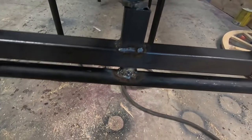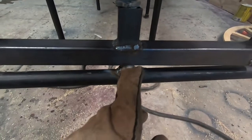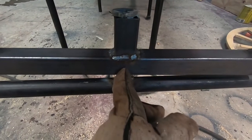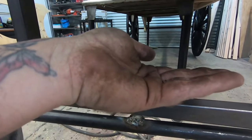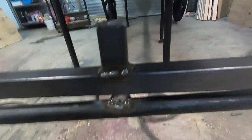I wanted to share this — I'll snip these things off with a torch. In the beginning, I welded everything kind of wrong. I cut this inch-and-a-half piece of metal almost in half and bent it so that instead of being level, it was bent up. The reason I did that was so a bolt sitting on it would only hit that area there, and I wouldn't have had to go through all of this.